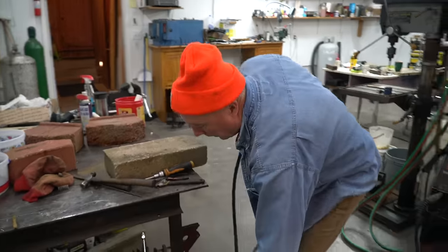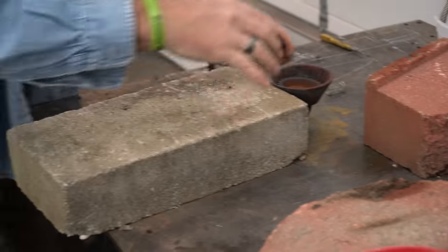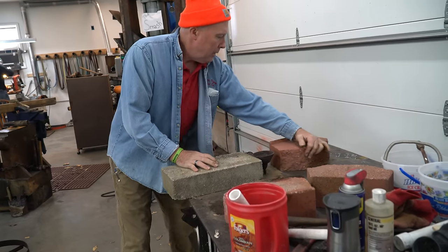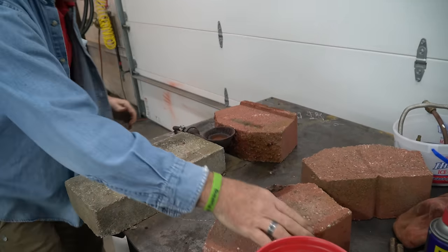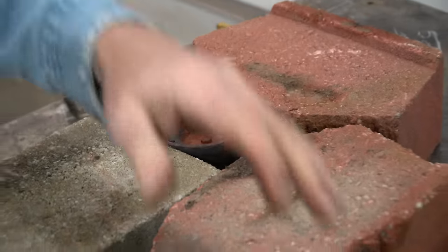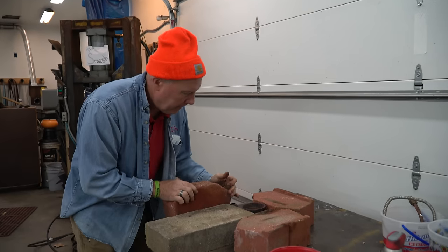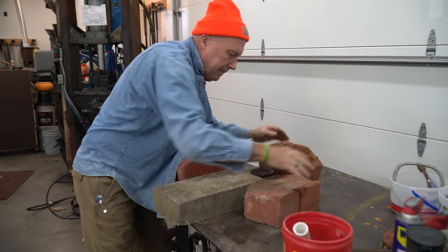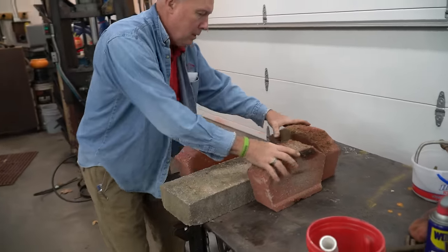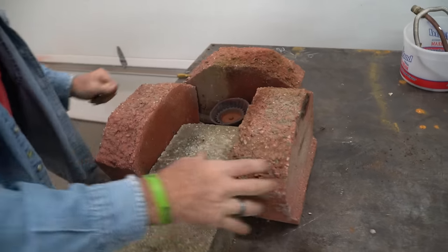Now we've got to configure the forge. We need to burn it from the back or the middle. We're just going to stack stuff up loose to see how it starts to go. We're not going to use these just to hold stuff in place — we're going to use other blocks to actually build the forge. This is just going to help hold items in place for us. Make sure everything is gently, slightly snug.